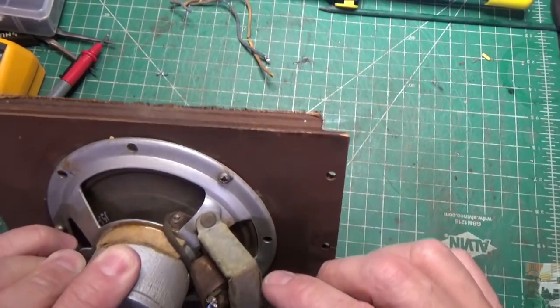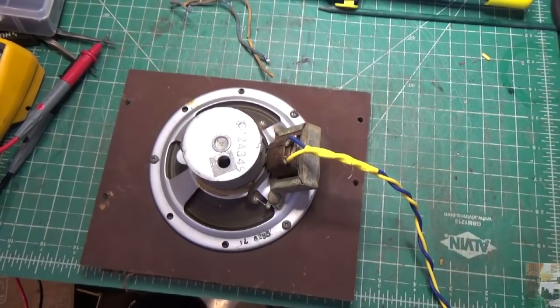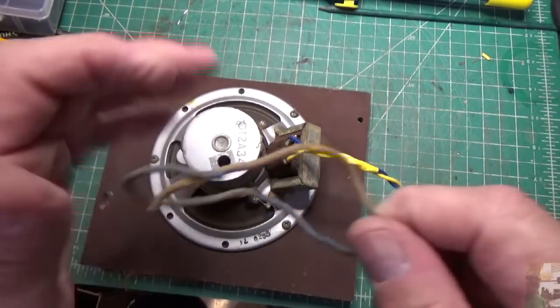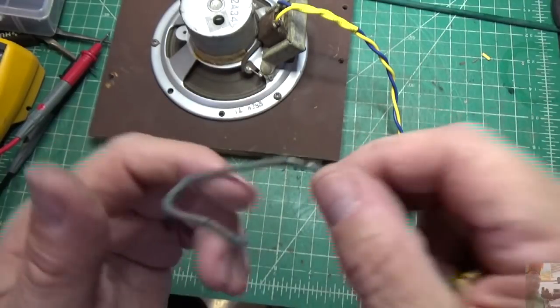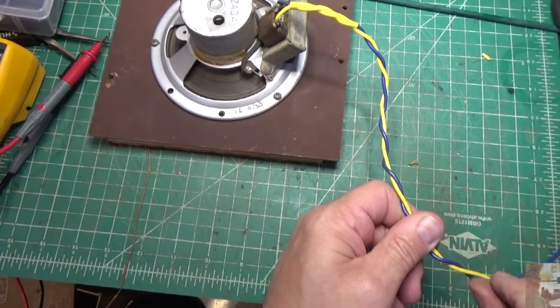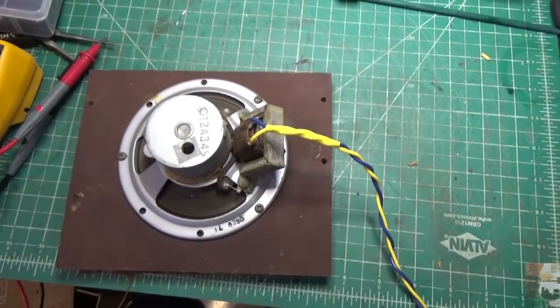With the exception of the grill cloth which I still have to choose, this speaker is cleaned and ready to go back in the radio — we know it ohms out good and it looks pretty darn good. I did find the model number of this radio: 04WG-468, a Montgomery Ward made prior to 1941. I also found the documentation, so now I know how to wind the dial string. This original wire is just disintegrated — hard as a rock, comes right off — so that's why we're rewiring the set.